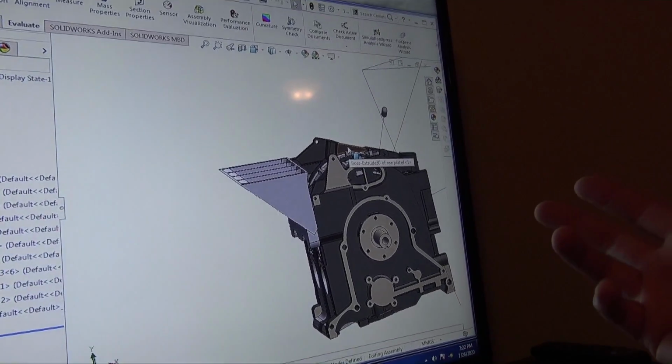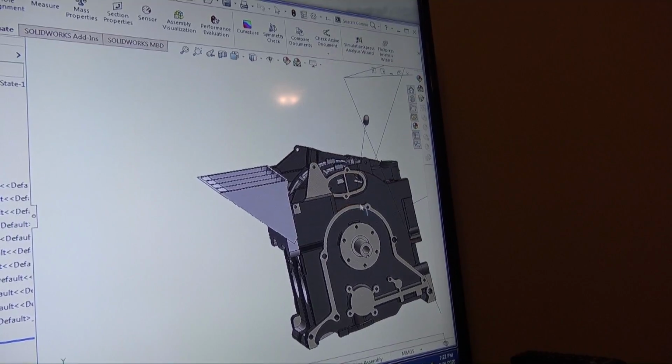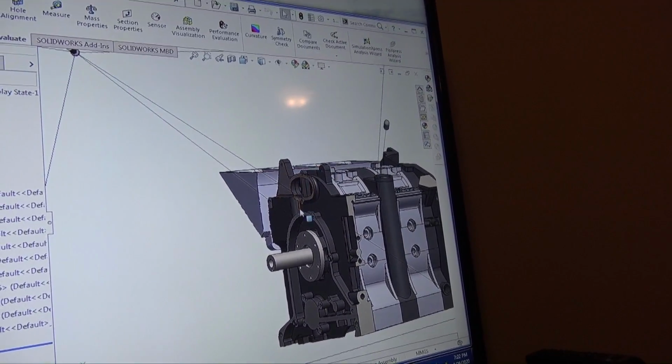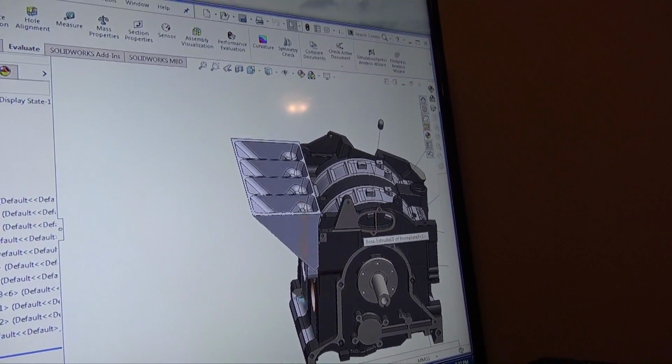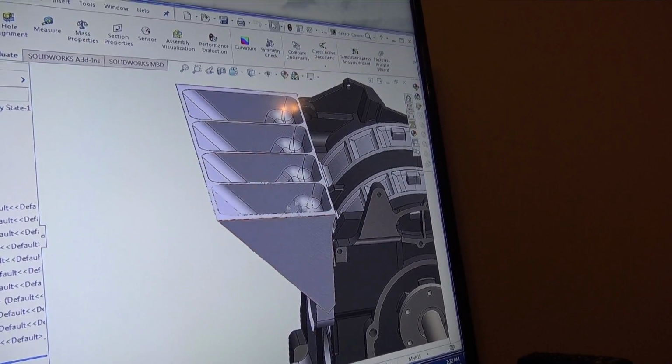And another thing is that I'm not going to run the normal coils. I have coil on plug, so I'm going to have the coils over here. There won't be anything on top of the engine that I have to worry about. I'm doing an electric water pump. My turbo manifold will clear all this. I'm probably going to actually cut this down.